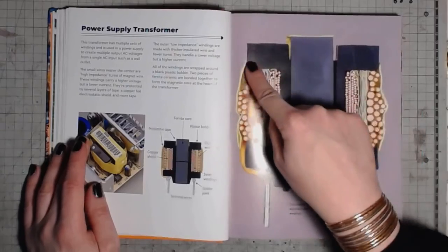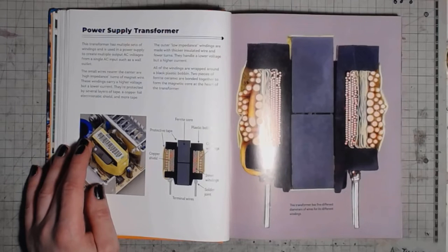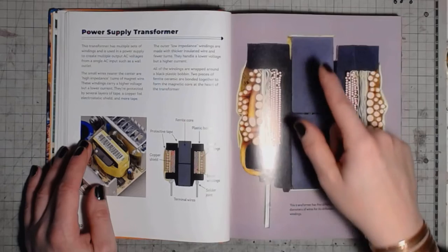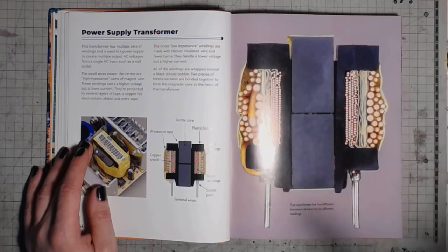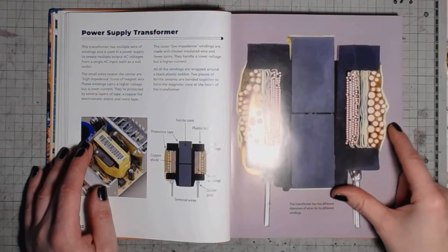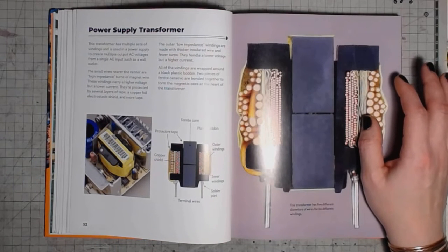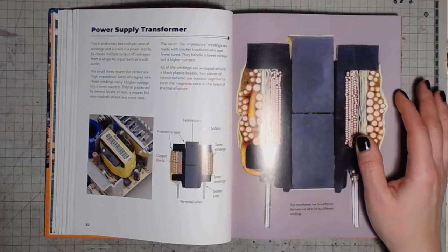The switch mode power supply transformer, those are very small and compact compared to the old iron transformers that worked on 50 or 60 hertz line frequency. Those transformers can be made very small, very cheap, very lightweight, because the frequencies they operate on go into the range of tens or even hundreds of kilohertz, which means that the inductance of the winding can be kept very small compared to what you would need for the mains transformer in order to get the same impedance.